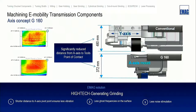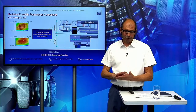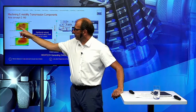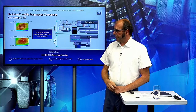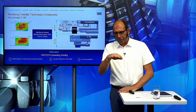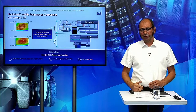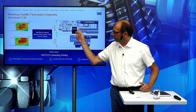The big advantage for this machine, when we are closer to the swiveling point, you can see in this picture. This is a photo which we have made of a gear surface, and you see with the conventional head, we have some ghost frequency on this photo. This is coming from the tangential axis. Here on the G160, there are not really ghost frequencies. These are fine waviness in the surface, which is maybe 1 or 2 microns. But this fine waviness in the surface creates noise in the gearbox,